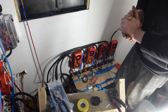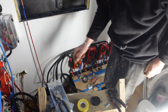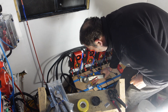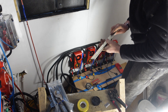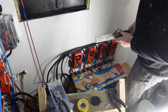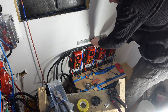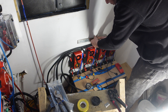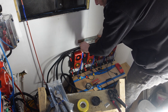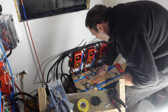All I need to do now is just carry on neatening them all up and run them across to the isolators. Then I've got a bus bar to do — tin coated copper — that's going to come here. And then the negatives will all work out anyway. And then just straight off to the shunt.